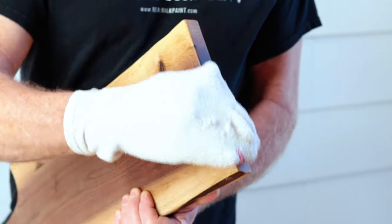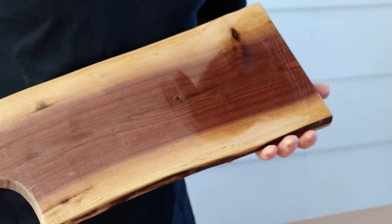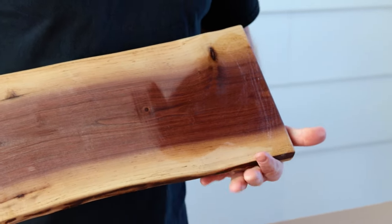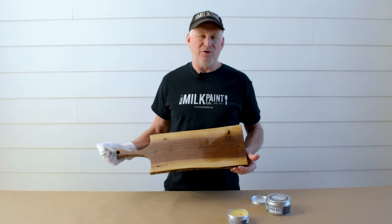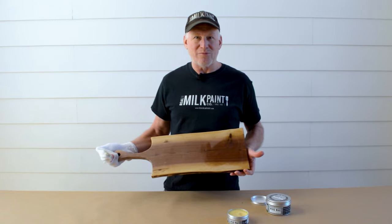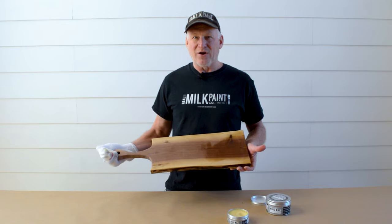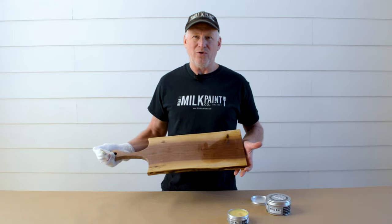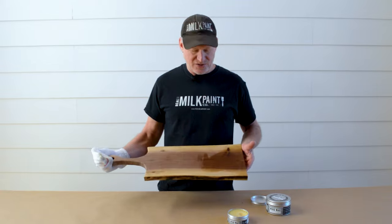Some people might have a concern about walnut oil, as far as, okay, what if I'm allergic to nuts? Well, because walnut oil is a drying oil, what happens is it polymerizes. And once it polymerizes, it's no longer a problem with nut allergies at all. So those oils that don't polymerize, like peanut oils and so on, those are the ones that usually are consistent with allergic reactions.